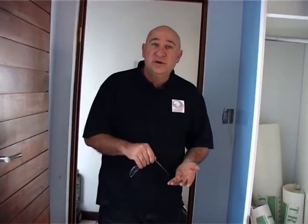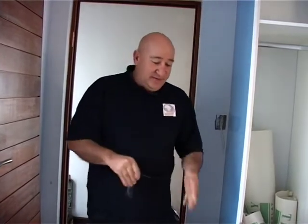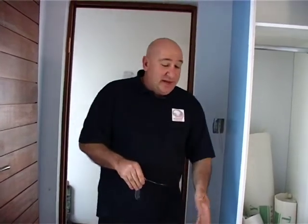Right, guys, as you can see, this is a cupboard. We don't have skirting around a cupboard, but we still need the expansions. So how do we cover that? Well, the best way is with a quarter round, a quadrant, or a scotia. Scotia is a quarter round inverted the other way. In this case, we've got a scotia, and the nice thing, guys, all these mouldings match the floor.